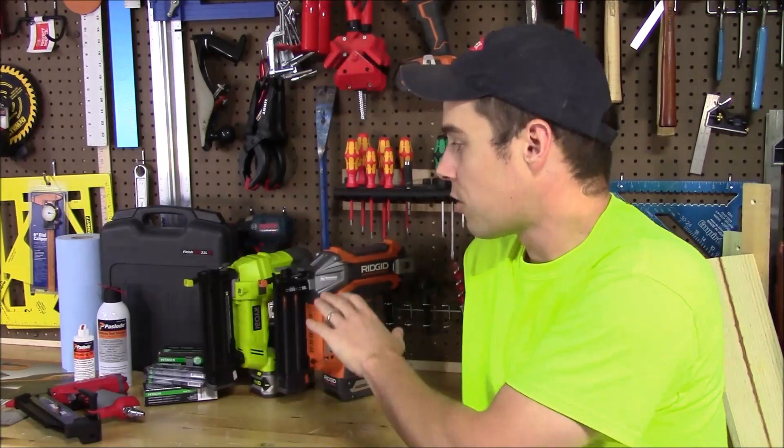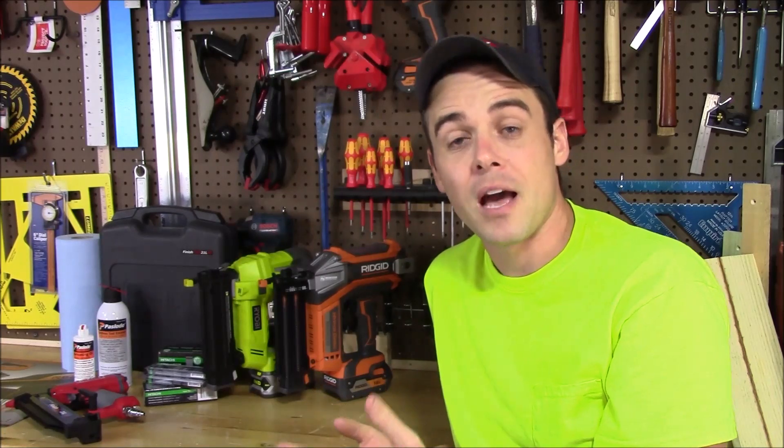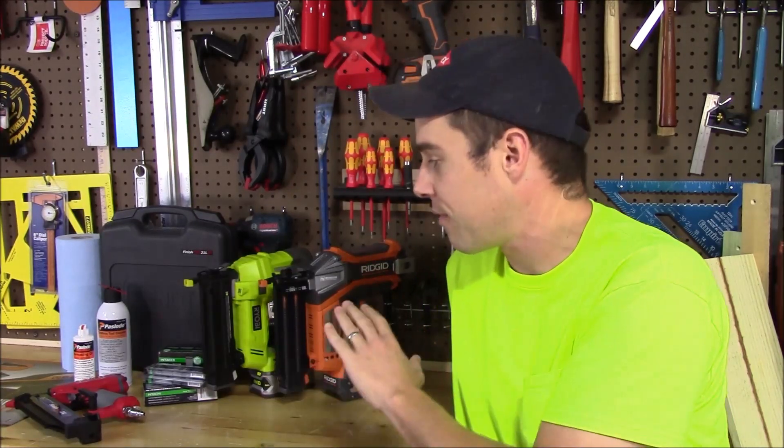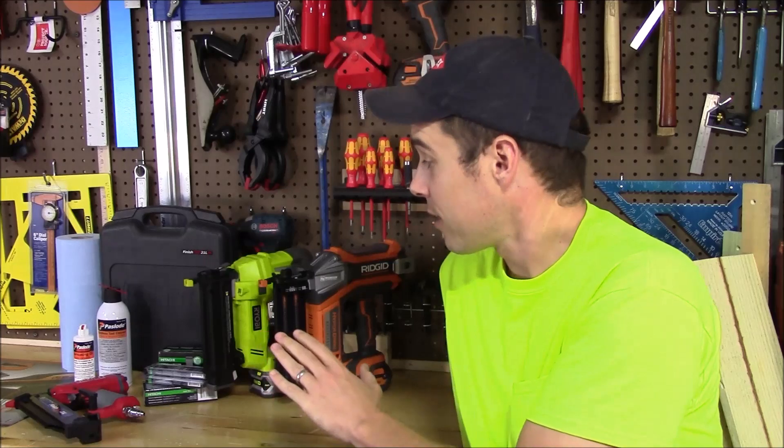So those are some of the best tips I can give you for keeping your tools running great and getting maximum performance — whether you're using cordless or pneumatic nailers. Keep them clean and lubricated, and the main other thing is to use high quality nails. I really prefer the Hitachi brand; I've had no issues whatsoever and they really do not jam on me. I've easily shot over 10,000 to 15,000 of them with zero issues. The Paslode tool cleaner and lubricating oil do an excellent job — the cleaner doesn't stain or melt plastic, and the lubricating oil leaves a clear film that doesn't gum up with dust and debris, keeping everything running smoothly. If you like this video, please click like; if you like my channel, please click subscribe. Thanks for watching.